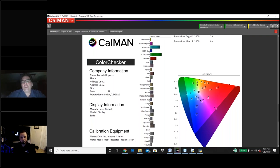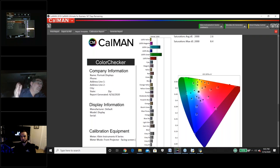Yeah. And on the newer JVCs, you can adjust the curve by using the picture tone control. You don't have to do an import, but there's actually a setting on the newer JVCs, I think it's called EOTF or the HDR gamma preset. Then you can turn the picture tone control up to get it to better match the yellow line, but you still have to use a screen multiplier on that. Great.